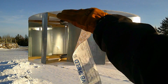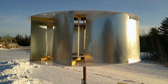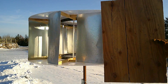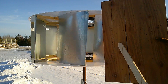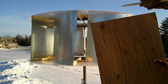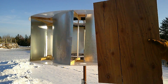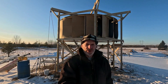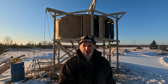Let me check the wind direction — it looks like it's kind of going straight into it. What you do is just take a sheet of something and block the wind on one side and divert it over to the other side. You have to decide what angle you want on there. So if the wind is coming in this way, it'll block this side of the turbine from the wind hitting it and divert the wind over to this side to add some more torque. Having wind diverters on this wind turbine was part of the original plan — a number of people have commented saying that's what I need to do, and I agree, I just didn't get to it yet.